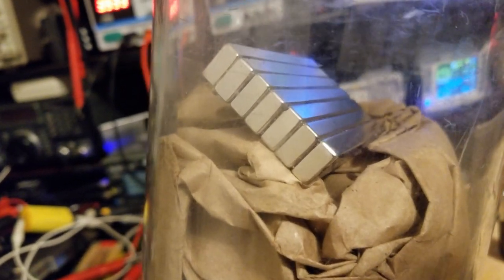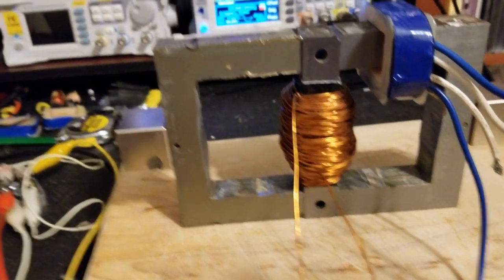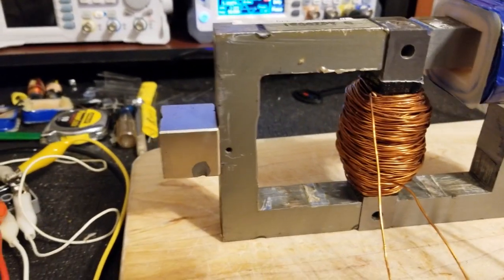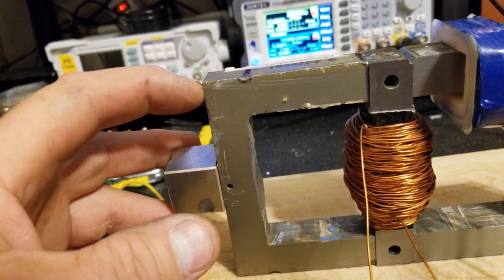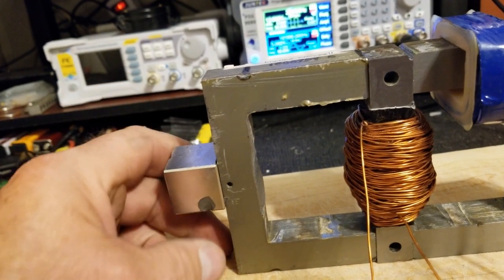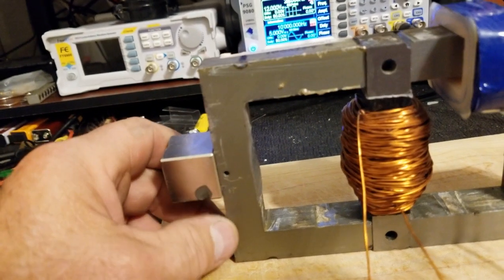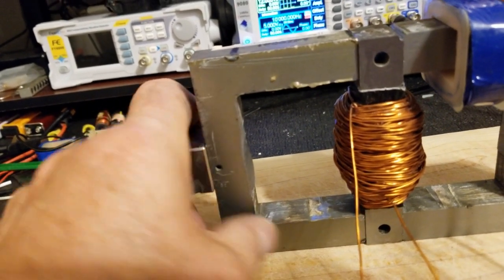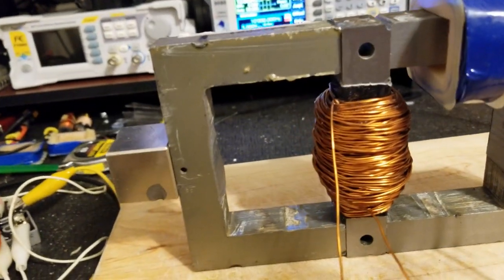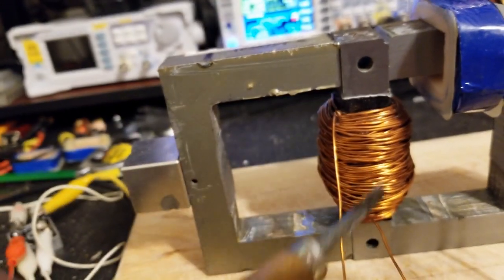I had three of these on each end of this core but didn't like how it acted. What I mean by that is it seems like when the magnet flux is right to the tip on both ends it's just too much, so you end up leaving some flux there and it ends up blocking — you don't end up oscillating the flux.